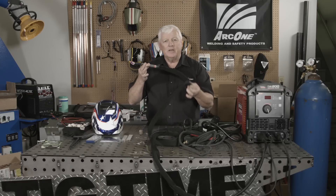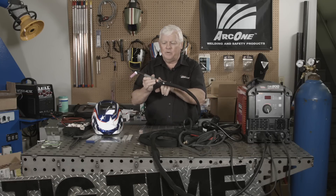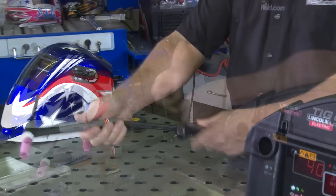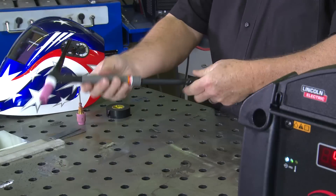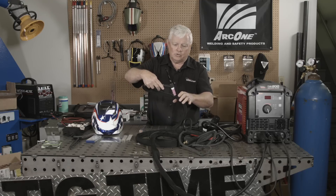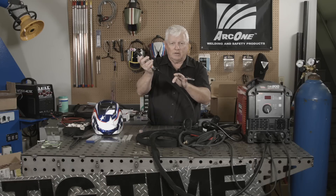The cable that comes with this is a super flex cable — very, very flexible. Once you take the cover all the way up on the handle and clamp it down, you take that flexibility away. So I'm actually going to cut this loose, pull the sheath down and tape it, and expose about six inches of the cable so I'll be able to flex it. Now here's the real concern: can your torch double back and burn your cable? Well, certainly it can — it can do it right here. But I'm just going to bring the sheath down to about there.